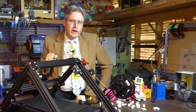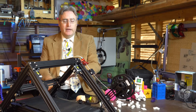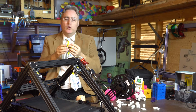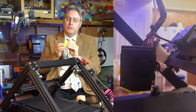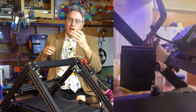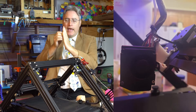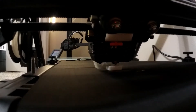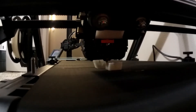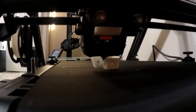Still, I thought there's got to be a way to make this happen. So to test it, I handed the CR-30 to a friend of mine and had him design a really clever little mounting bracket for the extruder head. This mounting bracket — you mount the extruder head to it and then mount it to where the extruder head went — and it holds the extruder head up at an angle that is parallel to the belt. Then we re-ran some of the G-code I had modified, and now with the nozzle being out of the way, it was able to print successfully layer by layer on the belt.